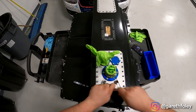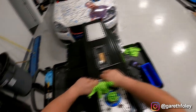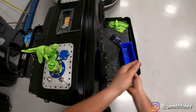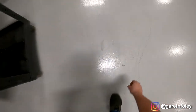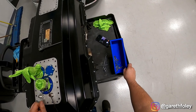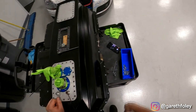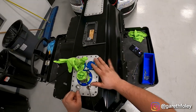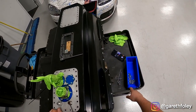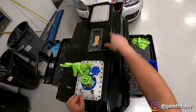So many cap bolts here — I guess I'd rather have the fuel cell assembled with many fasteners as opposed to very few. When disassembling something like this, I make sure all the hardware stays together — always keep a bin nearby. Disassembling these is actually really easy; it's basically just a bunch of four-millimeter drive cap bolts. These remove the access panels.